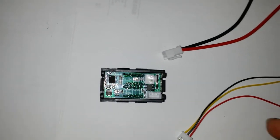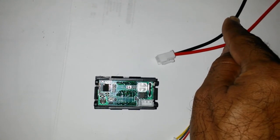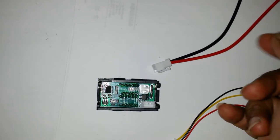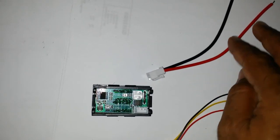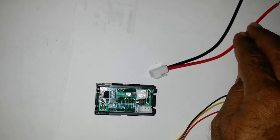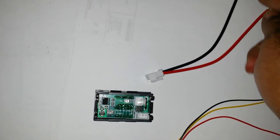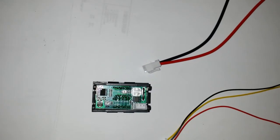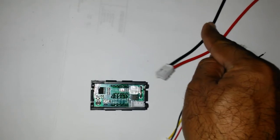So essentially what we have to do is connect this to the negative of our power supply and use this as a negative out to the load. So it's more positive than this negative. More positive is relative here, but it doesn't short off to the positive supply of our power supply. Because this joins to the negative, this joins to the negative of the load. So the current flows through this, is sensed, and goes back to the load negative wise. We wouldn't need to connect this if we're using one power supply, because this and this are joined.